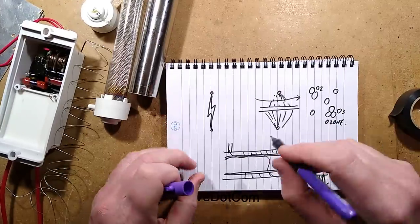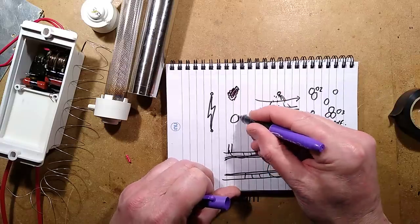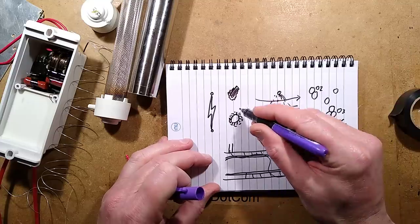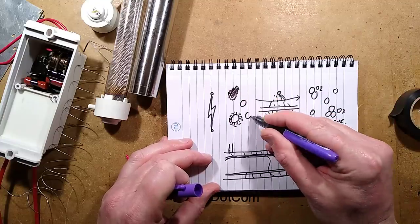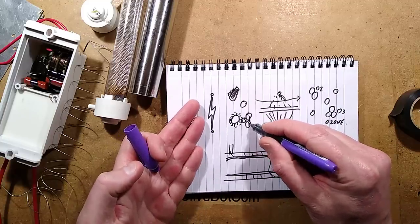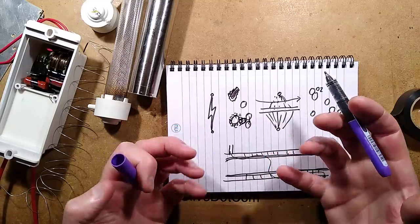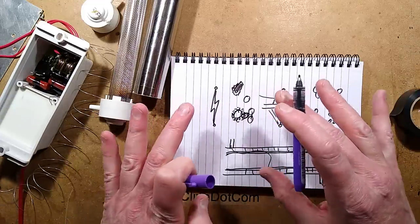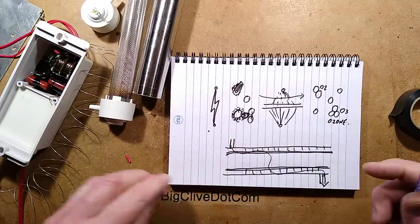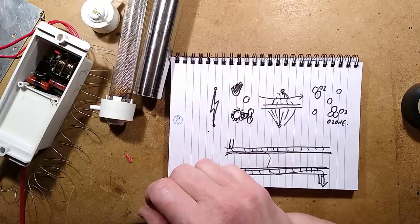While we're on the subject of ozone molecules, the science behind reduction of odour — and it can actually affect a virus. A free atom of oxygen, or the ozone, will touch the virus, and because ozone is unstable it wants to revert back to its stable state of O2. It imparts an atom of oxygen onto whatever it touches, oxidising it. That's why it smells like bleach when you have ozone in the air — it is essentially a gaseous bleach. It's particularly bad to rubber and can cause very rapid degradation of rubber bands and tyres.